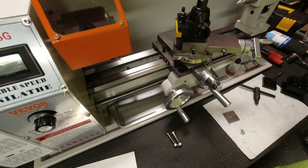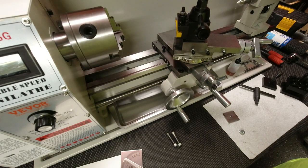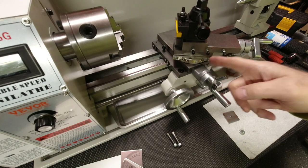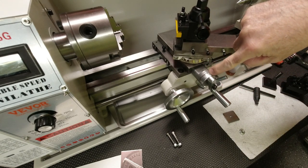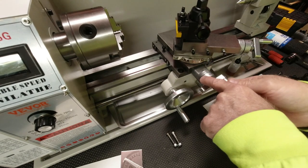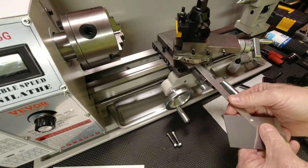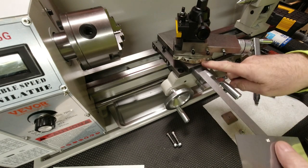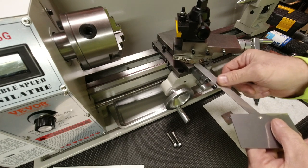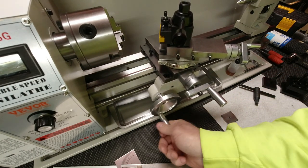I'll demonstrate this interesting little protractor in terms of how accurate it is. There's nothing on this scale telling me other than my assumption that this mark is the zero reference point — this dash at zero doesn't move, but this part moves. So we always have a zero here. I'm at like 25 degrees according to this, since here's 40, here's 30, here's 20 degrees.